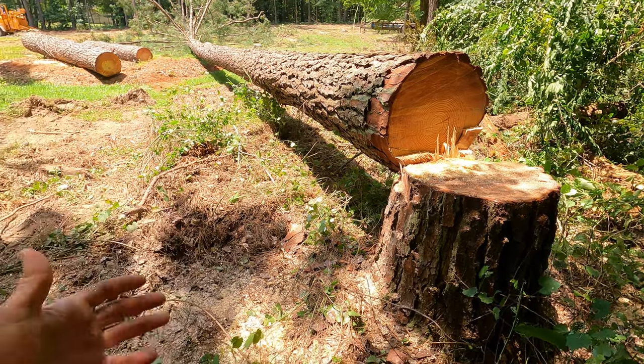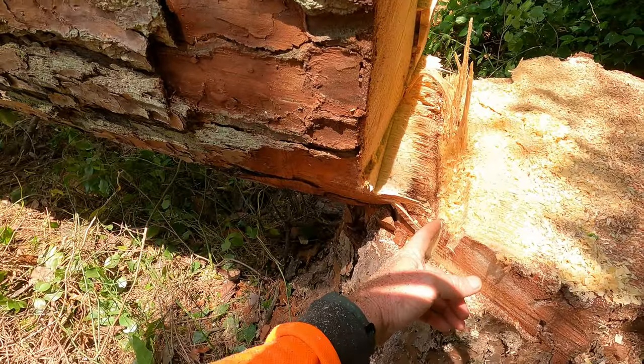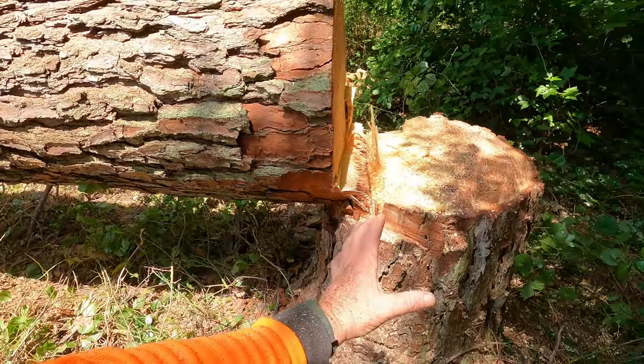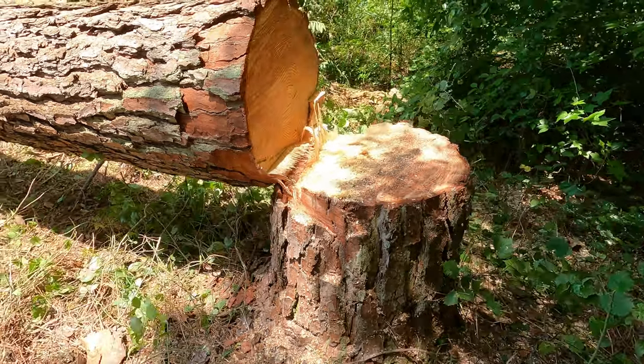Never cut like a 22 and a half degree notch, and always make sure that your apex right here meets both. It needs to meet perfectly. You need to practice on that to get that. If that don't meet perfectly, when it closes, wherever it closes at, it's gonna pop that hinge every time.